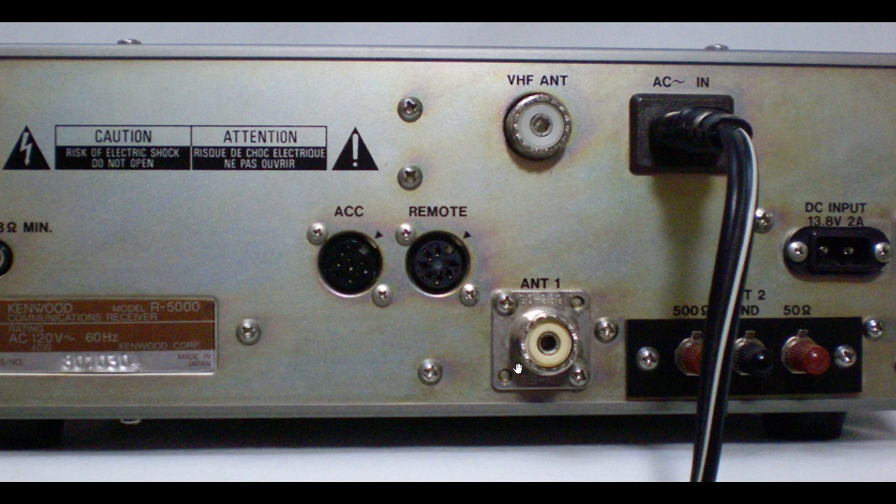The antenna coax connector itself will often be used for a more matched antenna with a coax cable. Notice that there's 50 ohms here, which matches 50 ohms here. You could technically connect any matched antenna through it. A good test: if you have a wire antenna connected directly to the radio, switch from the 500-ohm input to the 50-ohm input and look at your S-meter. You'll notice that if there's one S-unit difference, that's probably going to be the biggest difference you'll see — because a mismatch on shortwave for receive isn't that much of a problem.